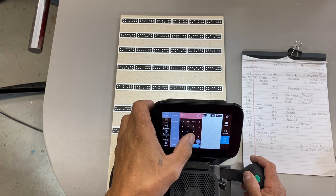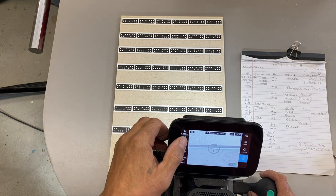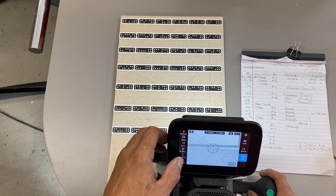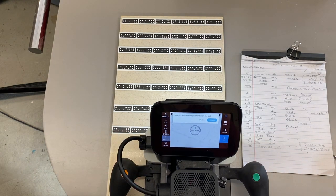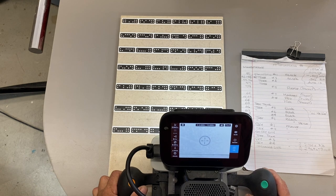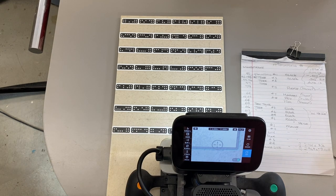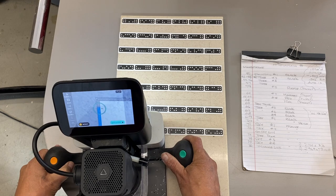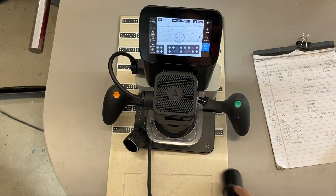To start, I'm going to go with a depth of cut of 1/16th of an inch — 0.0625. For inside, outside, or pocket, I need to hover over the path of cut and choose inside, then go with bit size which is 1/8th. Then Z-touch — let the machine figure out that parameter on its own. Drop it down. I think I forgot the offset, but I can set that at 10 thousandths for now. If you're already familiar with the Shaper this may be boring, but I watch woodworking videos all the time where I'm familiar with the process and I always learn a little something. Got that cut — let's vacuum up this mess and see how we did.